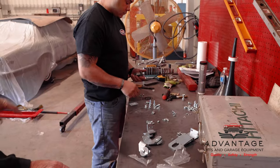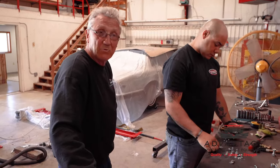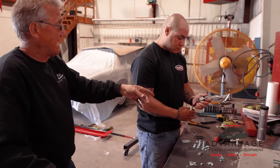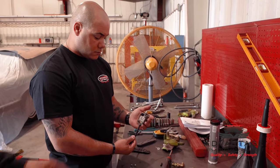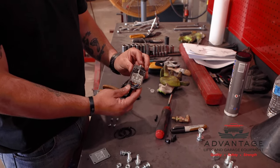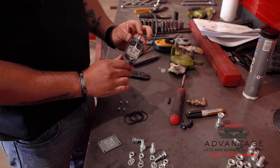Okay, what we're getting ready to do is put our overhead piece on. Like we said, we want to put it on and get the bolts in before we permanently mount our second column, so we make sure our distances are correct. But before we can put it up, we have to mount our overhead switch, and that's what LaCharge is working on here. What he has in his hand is a switch that goes overhead, and if anything were to hit it, it opens, disconnects your continuity, and will shut the power unit off. This will be connected to a power padded bar on the overhead, and it's a safety switch, designed to protect the lift and protect the vehicle if you have a tall vehicle.